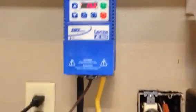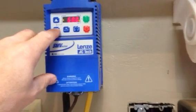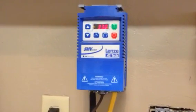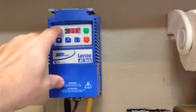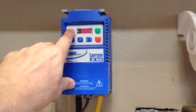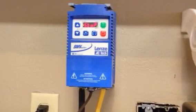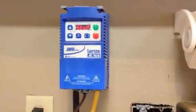Those are the three speeds I use the most often. If I want to, I can come in here and do any frequency I want — you can hear it slowing down — but I don't really ever do that. I just change it by using the switches because those are the speeds I want and need. I need to put it back up to 60. This VFD will actually go up to 120 hertz, though I've never used it that way. Theoretically you could use a 1750 RPM motor, crank up the frequency to 120 and spin it at 3500, but I only use it going down.